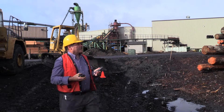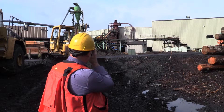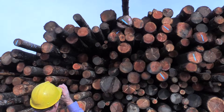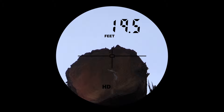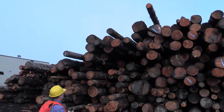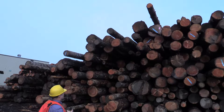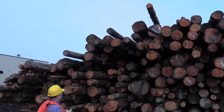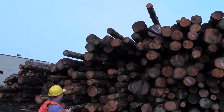Then I'll go back over here again, and I'm looking at break points in the deck. So I'm going to shoot the origin again, and it tells me right here that I need to shoot the top portion of the deck, at least the portion I'm facing into. I'm shooting my third deck shot. My distance is 19.5 feet. Now you see to the right of that is a smaller log that sticks out quite a ways away from the deck. We do not want to shoot that smaller log because the way it sticks out, we'd get a bad inclination angle to it. So what we do is we pick a log and a point on the log so that we get a good representative sample of the true profile of the deck.